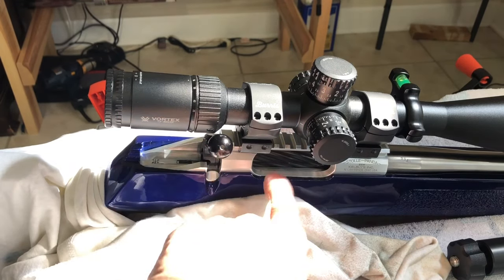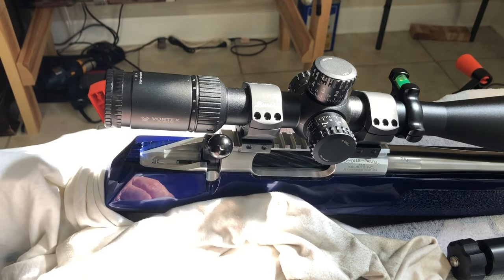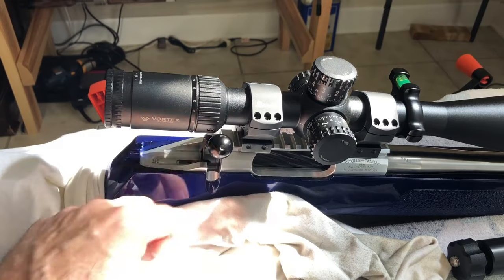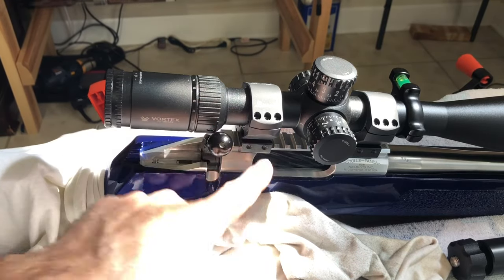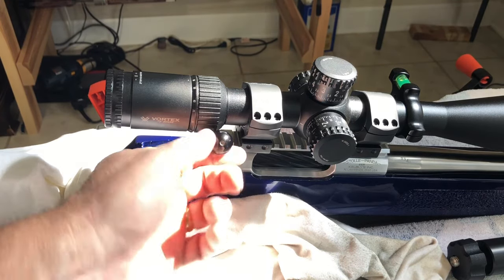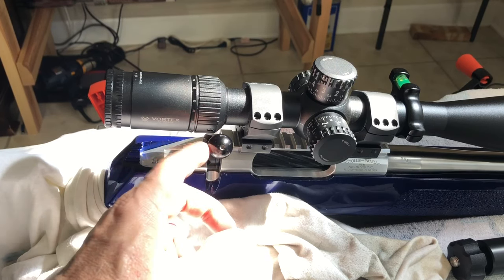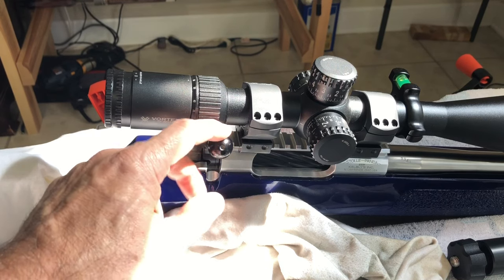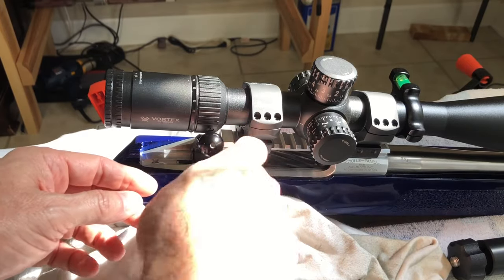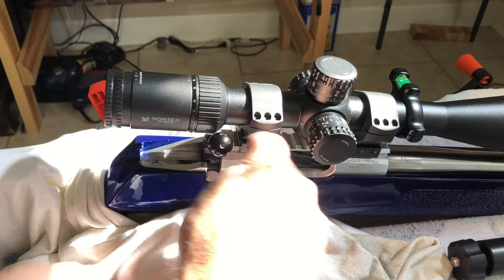I was only thinking that what was stopping this was the shoulder needing to be bumped back, as is usually the case after you fire a round. However, the other rifle has a larger chamber, and I'm not even sure the shoulder has hit the chamber yet — I'm getting a lot of resistance already and I can't push the bolt any further closed. The case in there is stuck already; I've got to tap the bolt to get it out.